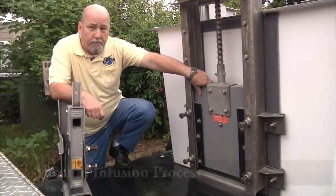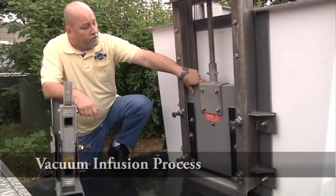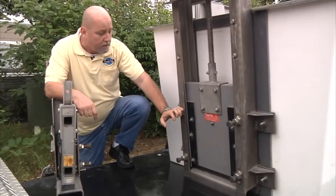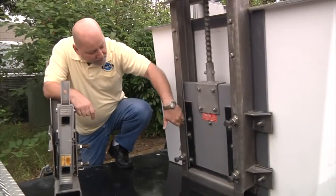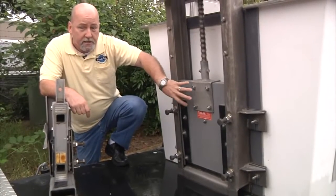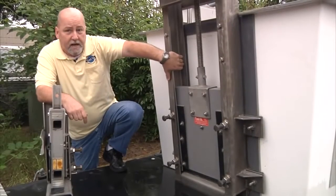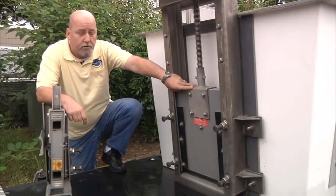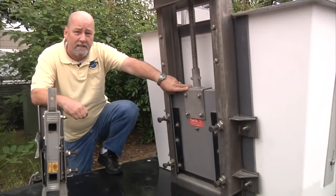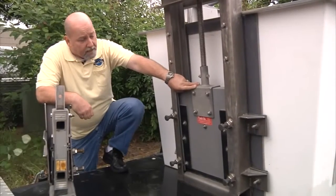The gate itself is a vacuum infusion process, and I'll explain that as we go along. As you notice, all the hardware is all stainless steel. It incorporates a wedging design — the wedge itself is a stainless steel bar that actually pushes the gate up against the seals, which seal up against the inside of the guide frame. This is a gate that is quite unique because we put the seals actually on the gate, not down inside the guide frame. Makes it easy to replace, easy for maintenance to take care of.